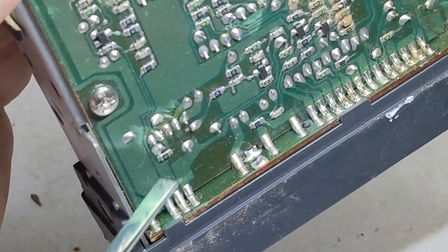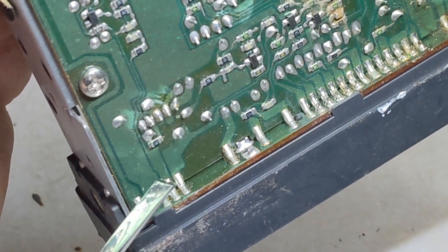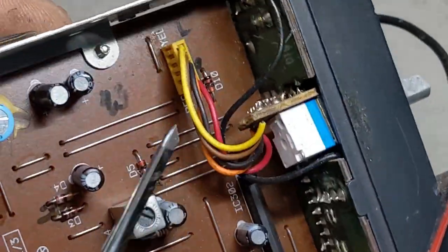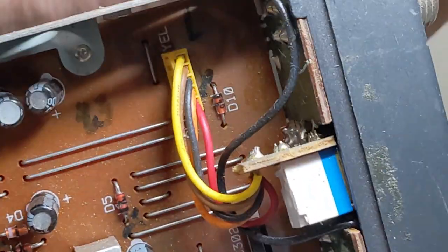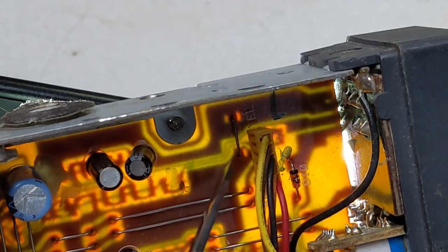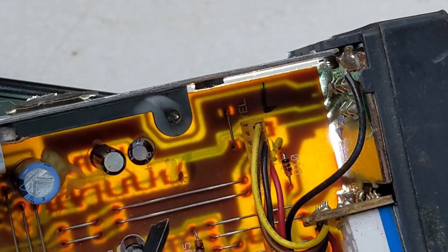You've got one, two, three, four — and I'm going to show you what to do. We'll put jumper leads to the microphone. Since we don't really have any good space except for that one hole there where you can get one wire through, I'm going to drill a hole into the board. Yes, I'm drilling into the board, right here — because on the other side of the board you only have these traces going along here. I should be able to drill a hole right here. I'll double check it by taking my light — you can see right through it. That is just a ground on the other side, that green patch. I'm going to drill a hole right here; it should not affect it as long as I'm not going into the smaller traces over here.